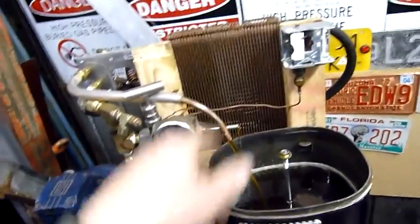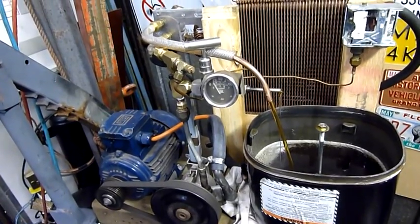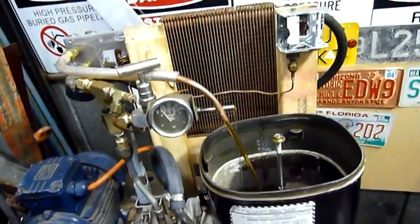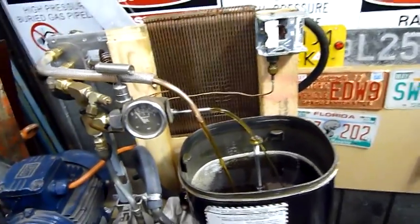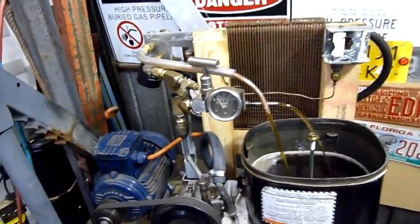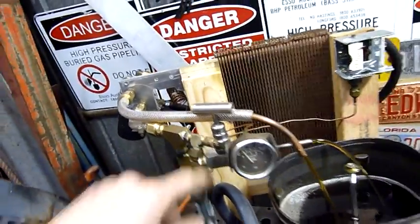Right now I'm just going to keep flushing the oil cooler and everything out. That's 53 hertz - just past its normal operating speed. It's doing its job. Pressure's come up a little bit - maybe 10 psi. Yeah, let's say we've got about 10 psi in the manifold; the needle has moved, there is pressure in the manifold here. The gauge is connected back there - I don't have a gauge for that position yet, but I'll put one on soon.